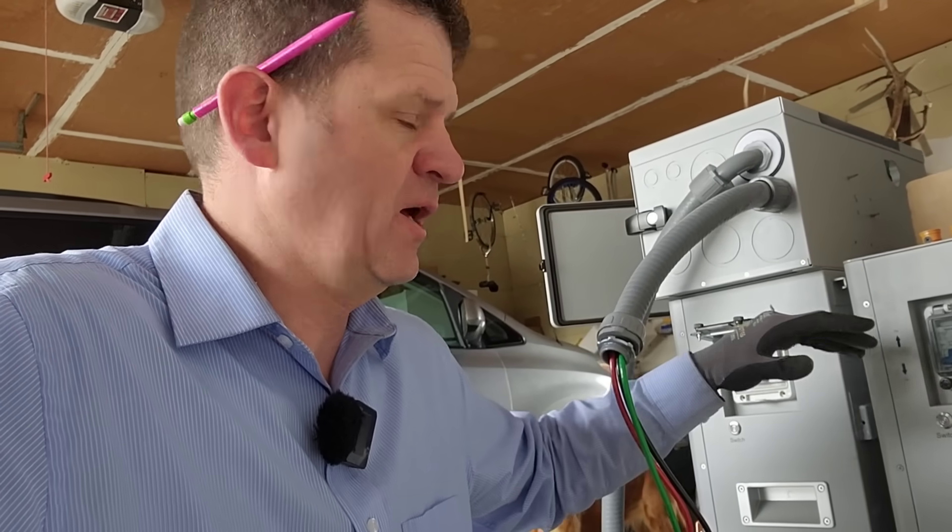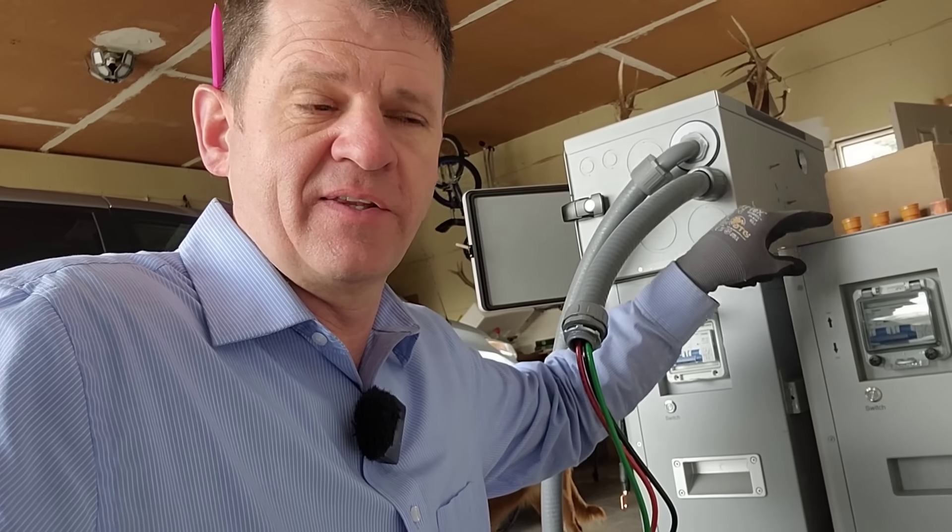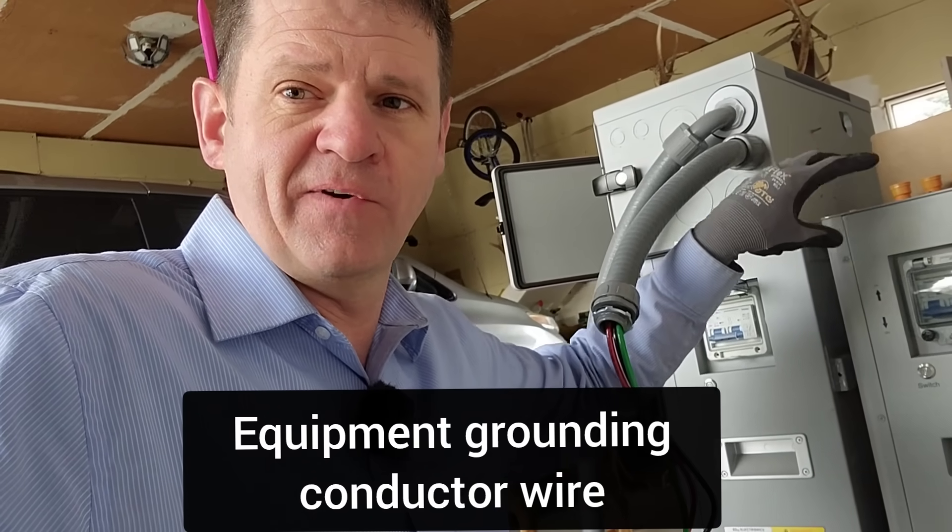On a lot of forums, when people are installing their own batteries and equipment and getting light flickering or other problems, technicians will recommend disconnecting the battery ground or the grounding system from the DC battery system, and that fixes a lot of the problems. But I think the better solution is I've ripped everything out and I'm going to make sure I have no more than one ground neutral bond in my system. I don't want any current going through my grounding system. I think I've found all the problems and I'll show you how I troubleshot and located the extra ground neutral bonds.